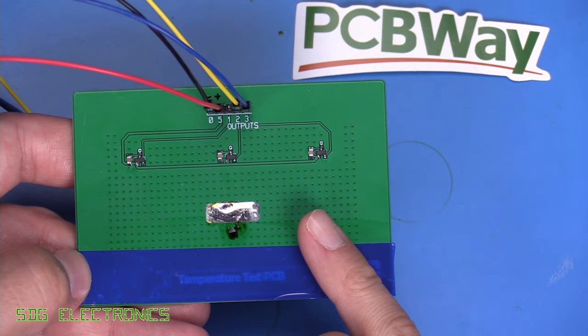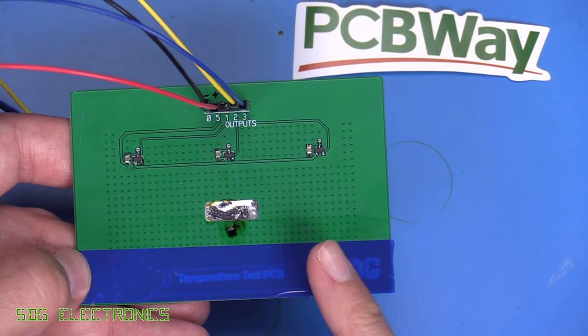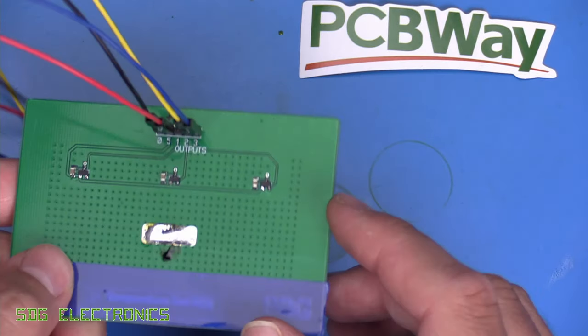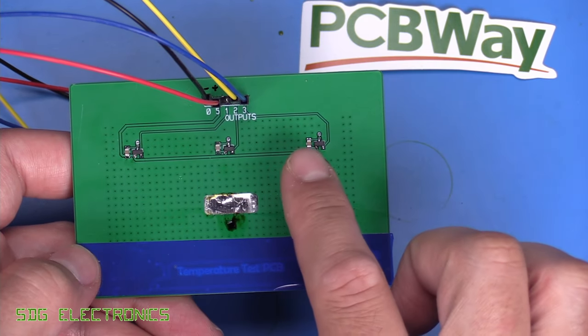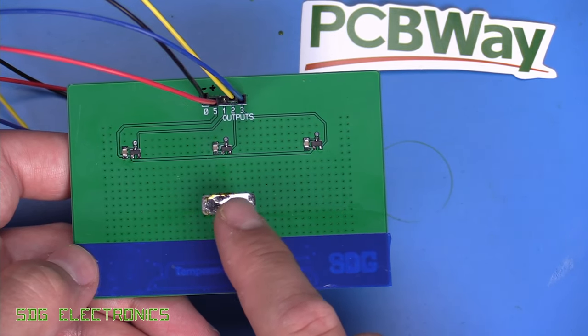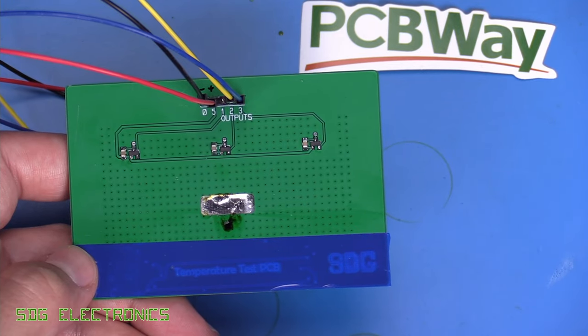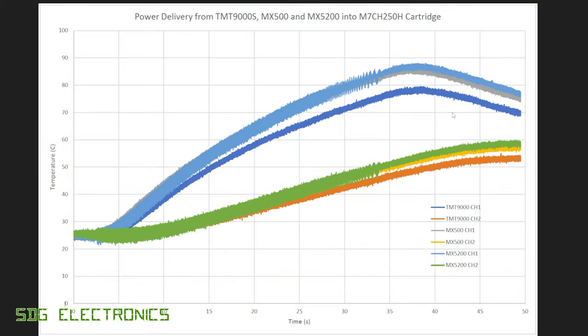Here's a little PCB made at PCBWay, used here for the first time as a thermal test board. It has heavy ground planes stitched together with one pad where we place the soldering iron, and temperature sensors on the board. The idea is we measure the amount of heat that is able to dissipate into this PCB from placing the soldering iron on the pad. We've got some really interesting results — there seem to be two groups of data: the lines at the top are from the sensor closest to the thermal pad, and the lines at the bottom are from those further away.